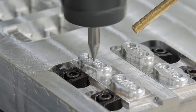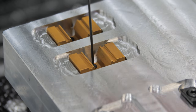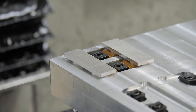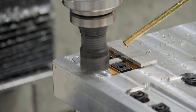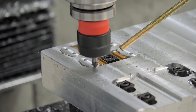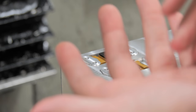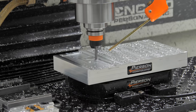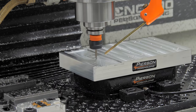I didn't want to keep using two screws per part, so I tried using machinable clamps for op 2. Now two screws gets me four parts. This worked really well, but I'm trading off turning less screws for using more material. Making buttons out of a big sheet might be worth trying. I'm the least happy with my new blade fixtures.